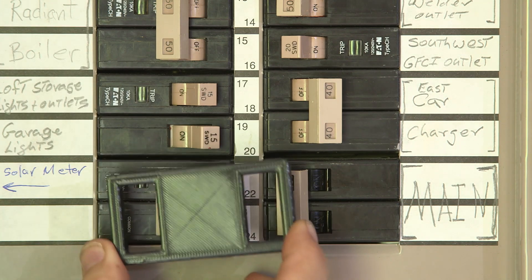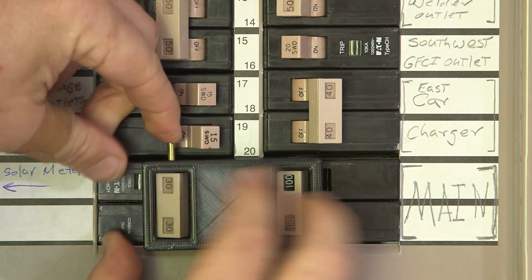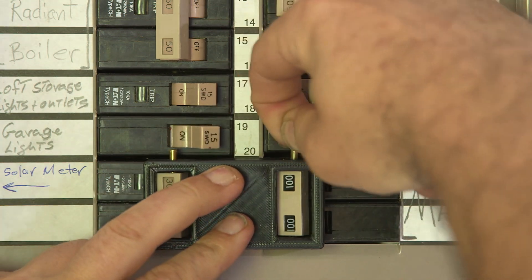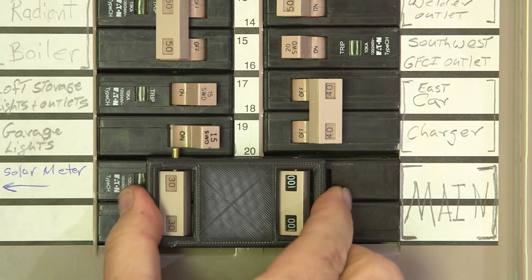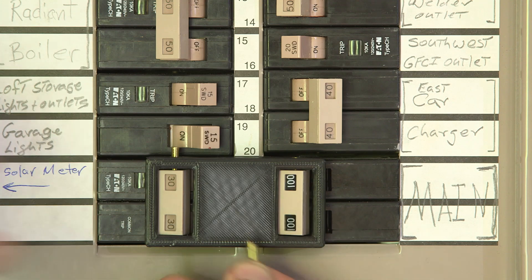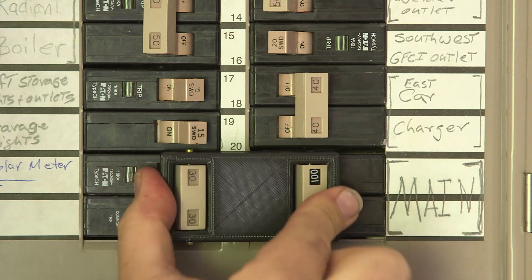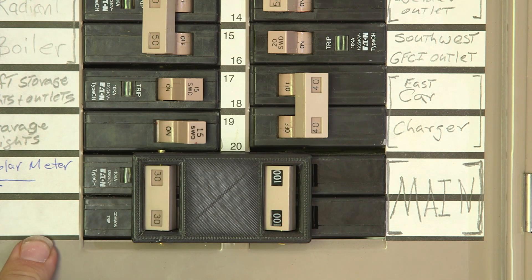So now all I've got to do is take my custom 3D printed part, put it over here, put the pin in, wiggle it around a little bit just to make sure we're in the right spot to get it into the breaker. It's a little wobbly, so I'm going to put some pins in from the bottom here too — connections top and bottom on both breakers, and on the outside and inside left to right of both breakers. It looks like a pretty good fit. Both these breakers are off. This one's on, that's off. Both off. Main breaker on, generator input breaker off.